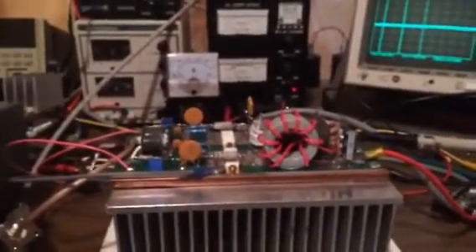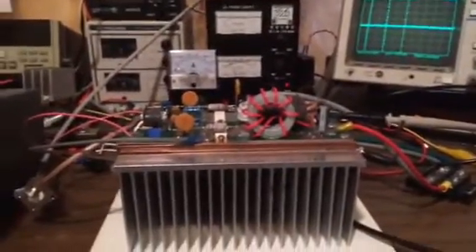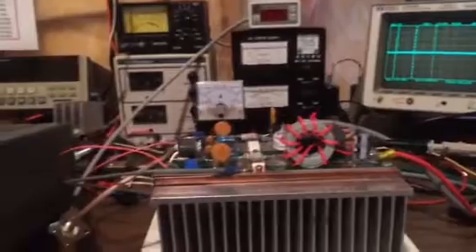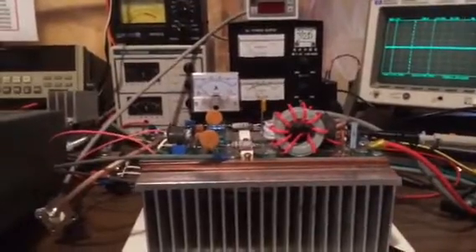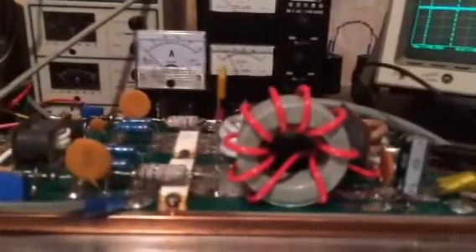Some of you asked what the sine wave should look like. It really depends on the configuration of your amplifier and the grounding. I've got my SO-239 connectors grounded with a very heavy ground braid. If you have the amplifier in an enclosure you'll get better ground and better shielding, so it should actually look even cleaner. Make sure your SO-239 connectors are well grounded and avoid too many ground loops.